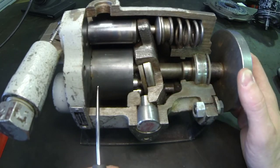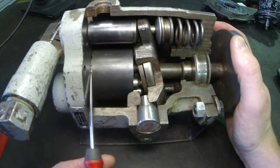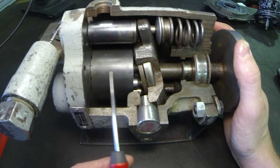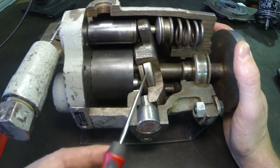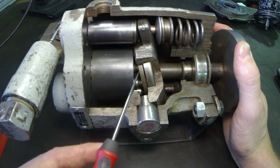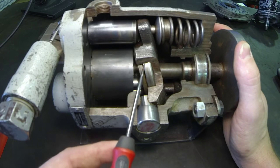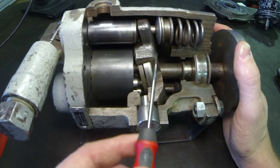On a piston block we would see an inlet side and an outlet side on the pressure plate that seals against this cylinder block right here. The swash plate is this steel plate right here, and these little slippers — called shoes — are going to ride against the swash plate, making these shoes follow the displacement that is set by the swash plate.